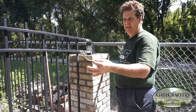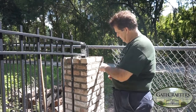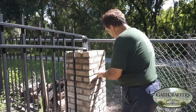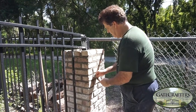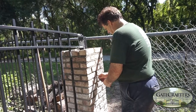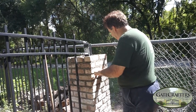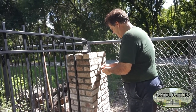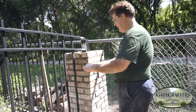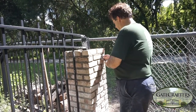The bricks have been up for two to three hours now. I'm taking my finishing tool and working the joints. Basically, I work from the corner in, because if you push toward the corner it'll push all the mortar out. Start and trim it off going this way. Do one pass just past the mortar joints, then do the vertical ones, and hit it one more time. I'm going to go over this again with a hose in another three or four hours, because I want it to look like it's been here for many years. If this is your finished look, you'd be really careful — but I'm going to hit it one more time with the hose to give it that weathered look.